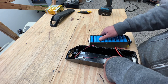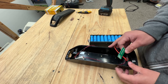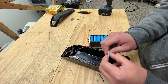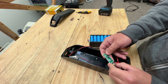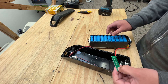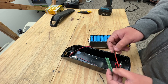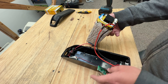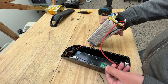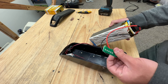Oh, maybe that's why it doesn't work. I thought maybe it was loose in there, so I keep pressing this but it doesn't work. It turns out this thing is missing — it's loose. These batteries are kind of cheaply made; they have hot glue everywhere. This stuff was just hot glued into the side of the thing, so it works itself loose. But it seems like this is a standalone system, just like on the other battery we did yesterday. So if you were to change the BMS — because this BMS is bad — then you could still have this work. It reads the voltage and then applies a certain amount of state of charge — a pretty simple device, kind of off the shelf in China.